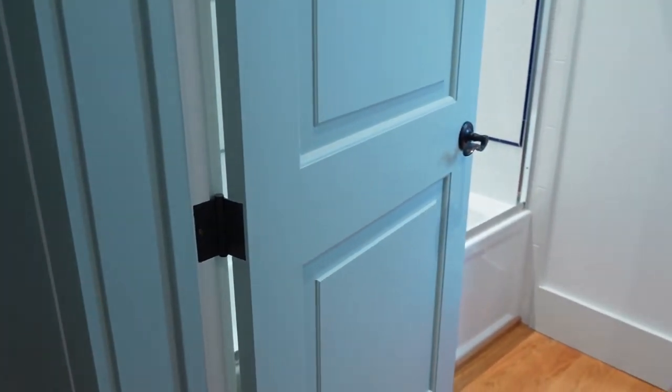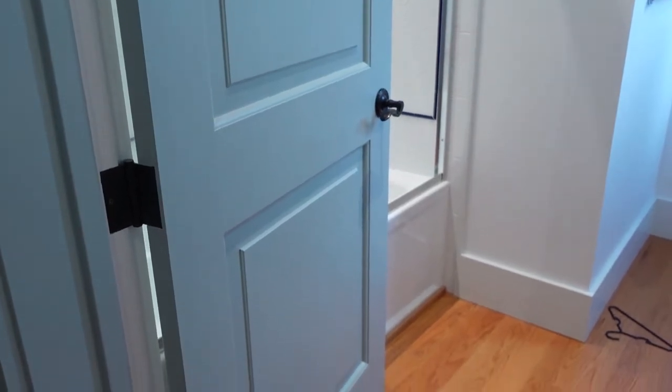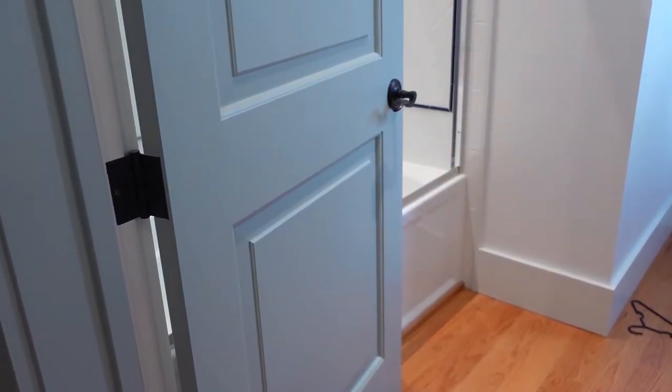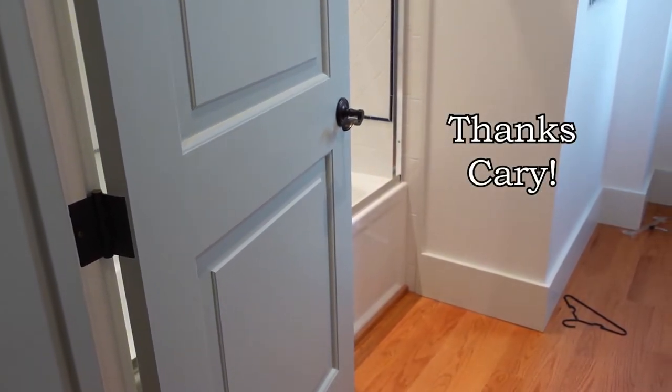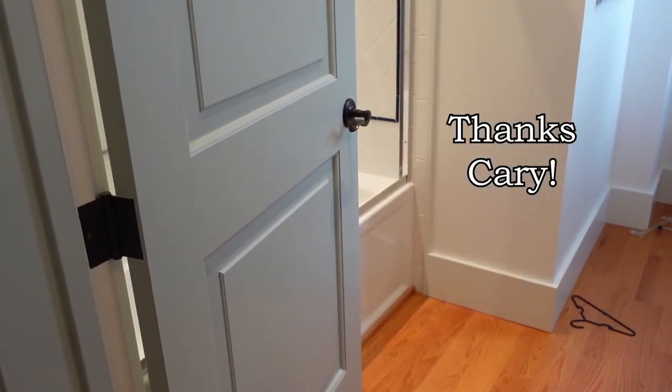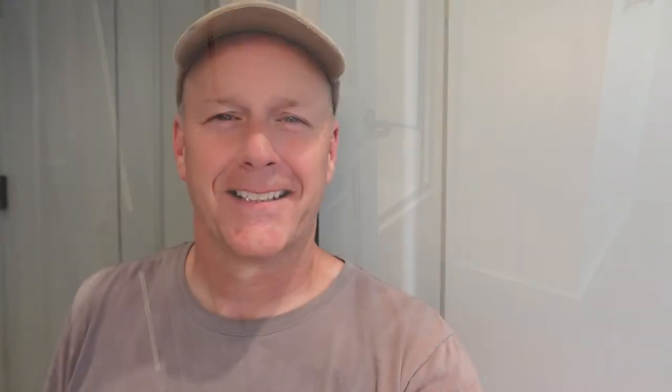If you look right there you'll see a scratch. I think the floor may be a little high right there, but definitely something got under it and when it did, it scratched the floor pretty bad. What we're going to do is pull this door off, set it up on a stand, and take a little bit of the bottom off with an electric planer that my friend Kerry got for me maybe 15 years ago. What an awesome tool. Come along guys and see if we can get this done.